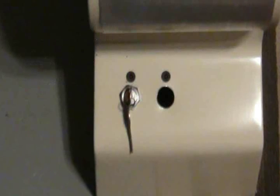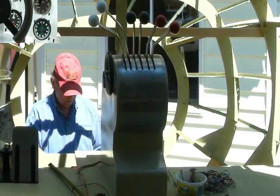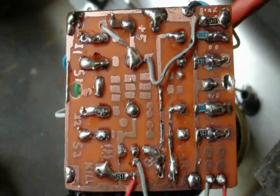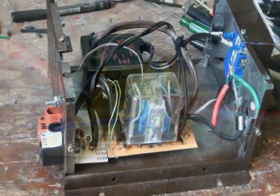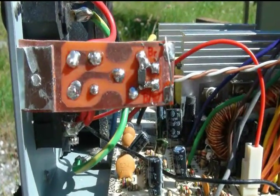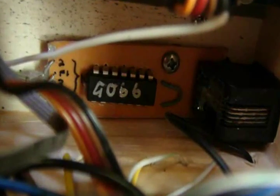The ignition keys look simple enough, but a whole lot went into making them control the main power-down sequence. The request by Barry, our resident pilot, was less than two weeks before the finish date. Because these switches are also used to turn on the battery and avionics in the plane as well as start the engines, a bit of circuitry is needed. The relay switchboard switches the keys away from the main control box when the simulator isn't powered up. Instead, the keys turn on a large relay in a box located aft in the plane. This relay connects the 120-volt mains and also the 12-volt batteries that power all the plane's lighting and low-voltage gear. The relay is big enough to drive a 1000-watt inverter if need be. Because the computer must power up automatically, some modifications were made inside of its power supply. This allows the control box to properly start up or shut down the computer, depending on where the ignition keys are set.